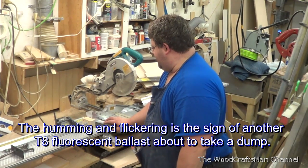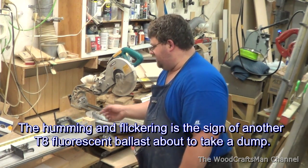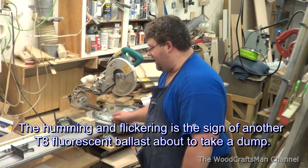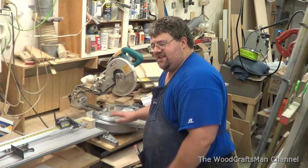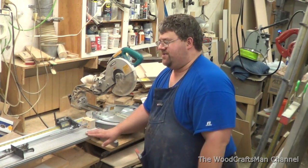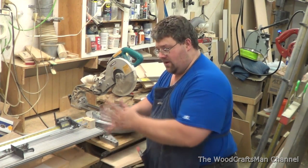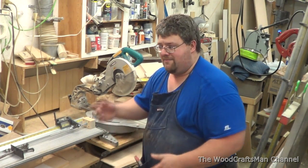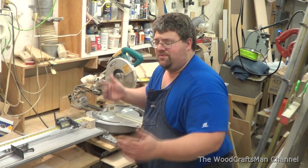This one is about 11 years old. It's been really good. I recently re-squared it. The fence was out of whack, so I re-paralleled the fences again. It's been good, but what we're going to do is take this out of the shop and keep it strictly as a mobile unit, so when we're on the job site doing base trim or crown molding, we can take it with us, because it just folds up into a few pieces.